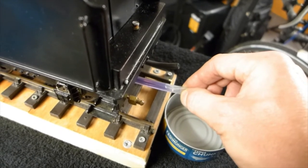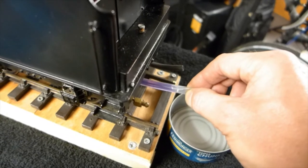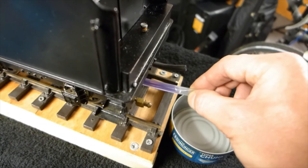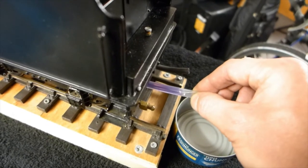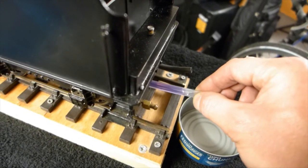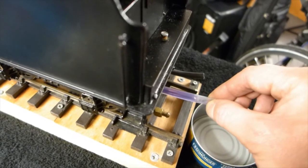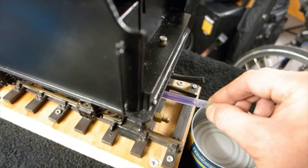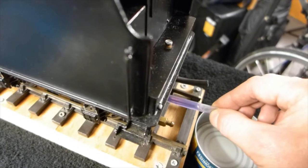If the loco wasn't working hard or using much methylated spirit, there would be no meths being delivered into the sump now at this point. The sump has methylated spirit above the level of the angled pipe, so no more is being delivered. It's only as the locomotive uses a spirit that more is delivered.